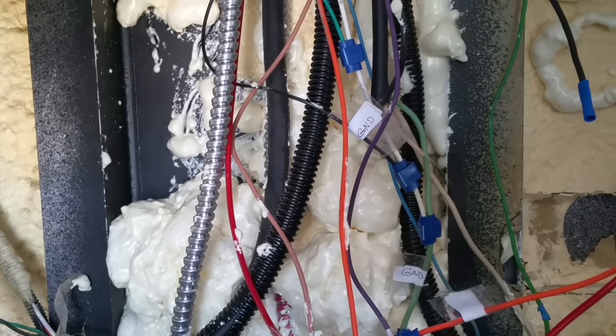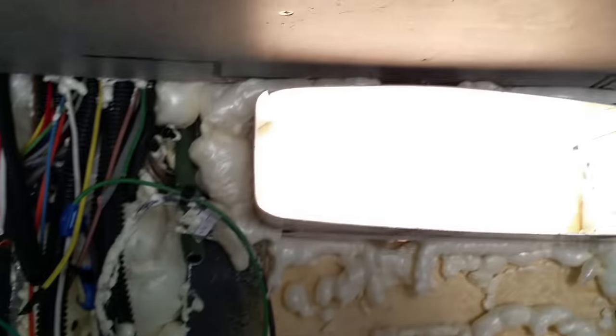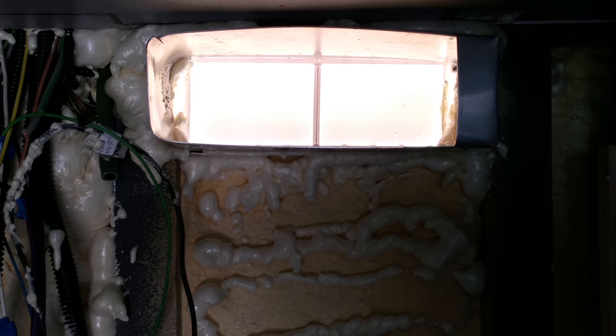Today I'll get the panel installed. I've got a 110-volt receptacle to put in this panel, a propane and carbon monoxide detector to put in this panel, and then the panel itself. What I've done is used a piece of quarter-inch plywood and used contact cement to stick a piece of aluminum sheeting on it - that's going to be the back panel. I just have to cut the holes for the outlet, the control panel, and the carbon monoxide/propane detector, and notch out the top for the vent hood.